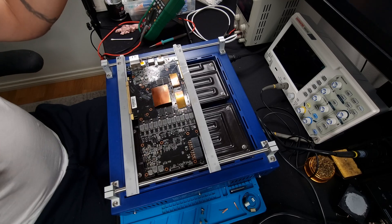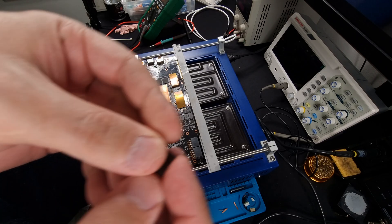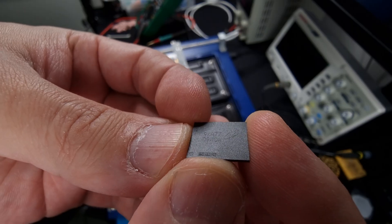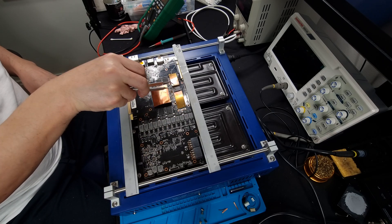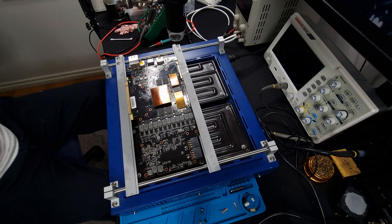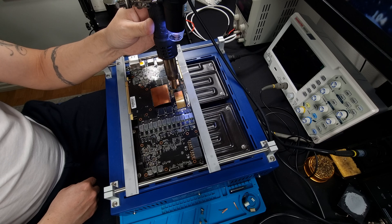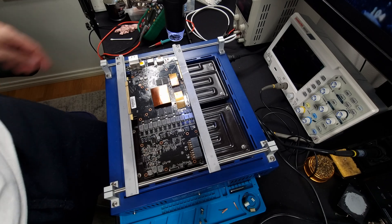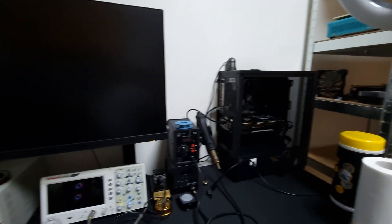Let's put our new chip on — we're going to be using a 2019 chip. You can catch the number nine at the top — that's the year. Apply a little bit of flux, not too much. Let's go ahead and apply hot air. My air temperature at this point is 375°C — that's just what works for me, you could lower it to 350 or 320, but I stick to 375. That ought to do it — let's turn this off and wait for the board to cool down.